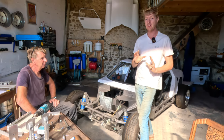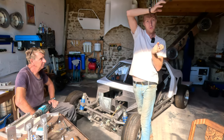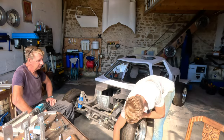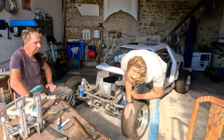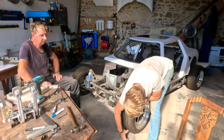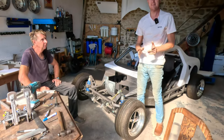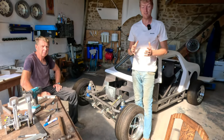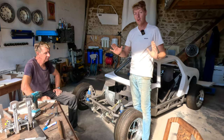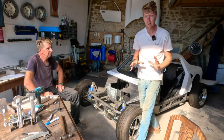And not only that, it causes something called tyre squirt, which is a bit like, you know how a supercharger rotates and squeezes the air through, like a Roots supercharger? Well, a tyre does the same thing. Air hits the front of your tyre, and because your tyre is rotating, it pulls the air down the tyre and it collects here between the road and the tyre. Like a bow wave on a boat. Yes, superb analogy. And then it fires it out the side under pressure, which ruins all your aerodynamics. So the less of your tyre, the less of your wheel that's exposed to the air, the better.